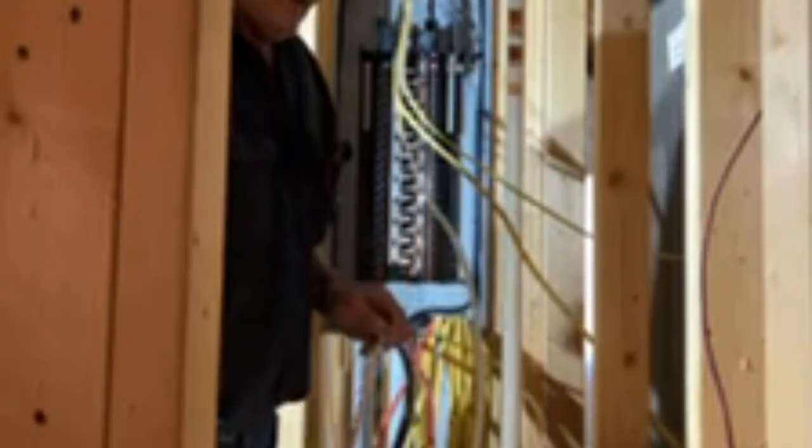About to put breakers in the breaker box. The way I do it is I take an old piece of sheathing off the wire, put numbers on it, and I cut them to put on the individual wires so I know where they go. Like the number 1, and then what I do is I skin the wire, put these numbers on all the hot wires, and that way I can know what circuit goes to what, because I write them down on a corresponding piece of paper for the number. Like number 1 is going to be smoke alarms.